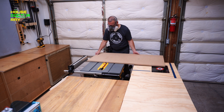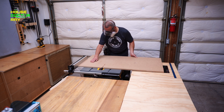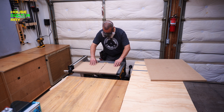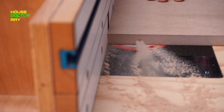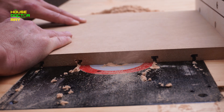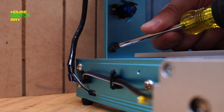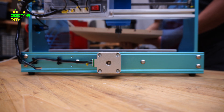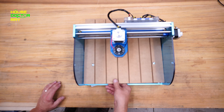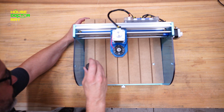Before I tried cutting anything, I thought it would be a good idea to put a spoil board on it, so if I do something wrong I won't dig into the aluminum base with a router bit. I got some MDF, cut it to 14 by 14, and routed some T-track slots in it to use bolts to hold things down. I also had to remove a wire tie-down point on the machine. If you do this, I recommend drilling the mounting holes before routing the groove so your screws don't end up too close to the groove like mine did.